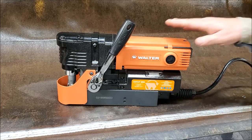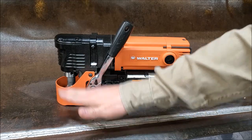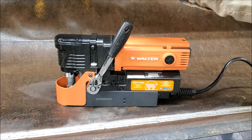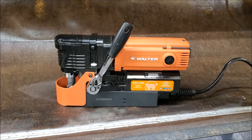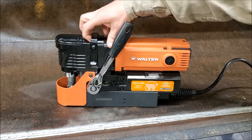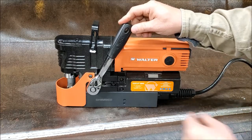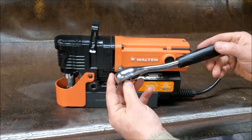Other features: you can see it's very low profile, great for I-beams and frame rails. From the base to the top is only seven inches. There are no exposed wires — a lot of upright mag drills have that loom of wires from the motor back to the power source that can get hung up. Everything is compact here. To carry this around, it simply has a handle and a ratchet since there's no three-spoke handle like a typical mag base drill.